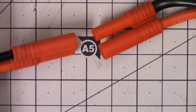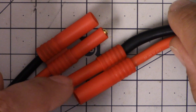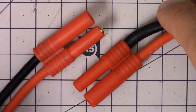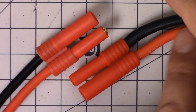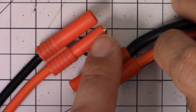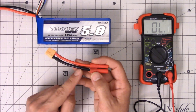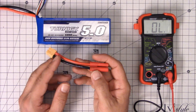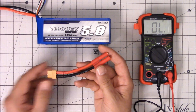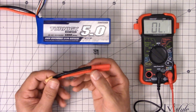I built this, and if I've put the shroud on backwards or done something wrong I could get into trouble. So I'm going to do a visual inspection. The black wire goes to the big one which has the female connector in it, and the small one with the black wire goes to the male connector — that is correct. The red one goes to the big connector with the female, and that goes to the red wire which goes to the little shroud with the male connector. Physical inspection checks out. I hate when people do builds with all-black wires for aesthetics because it prevents you from doing checks like this. The red and black wires are there for a reason, and using them — especially for big batteries — is an important safety feature.